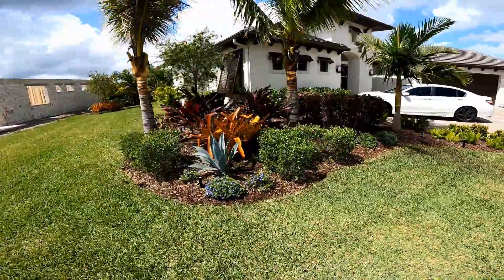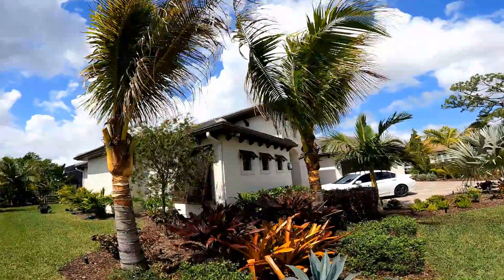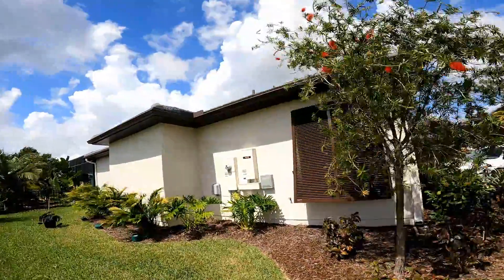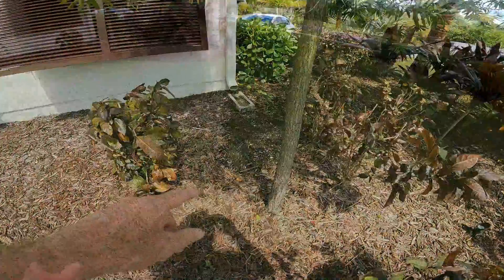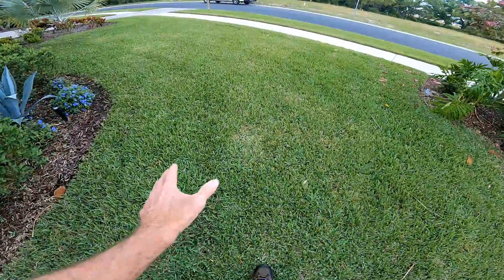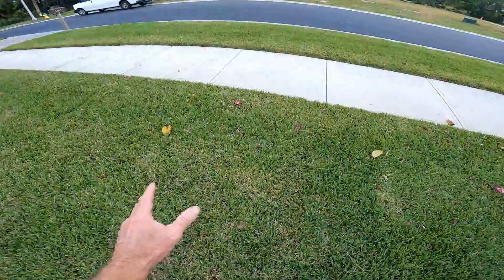The final thing contributing to this problem is the roof. There's a great deal of roof on these Florida homes — they're huge and they catch so much water. All of that water travels down and there is no downspout drain, so it goes straight across the yard and ends up by the sidewalk. It does move under the walk, but gets trapped between the walk and the curb.